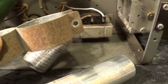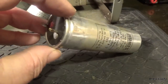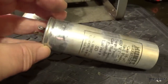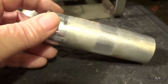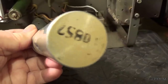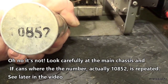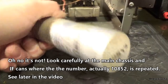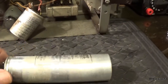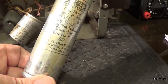I'm going to need to clean this clamp up a little bit. One thing I notice - if anyone ever tells you that electrolytics aren't shiny when new, look at this one. This one's just come out of the clamp, you can see the dirt where it's been exposed and it's all shiny where the clamp's been on it. Looking at the number on top - 0852 - I suspect that is in fact a date and this is a replacement, even though it's the right size, looking at some pictures of other people's U102s on the internet.